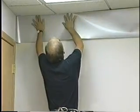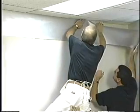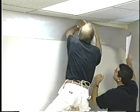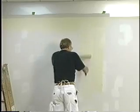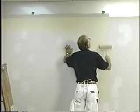Be very careful not to scratch or crease the surface of the wall talkers. Be sure there is no debris on the back of the wall talkers before installing. Remove any debris with your finger. Apply adhesive to the wall for your middle sheet. Remember to paste 4 inches on the surface of the first sheet.